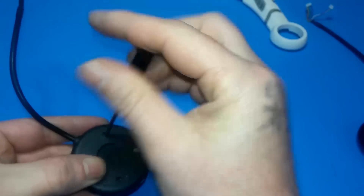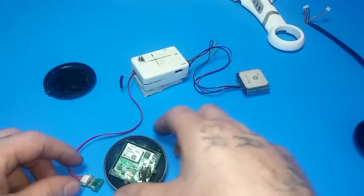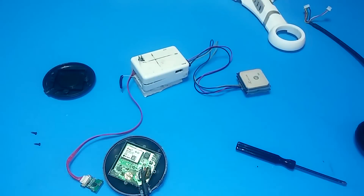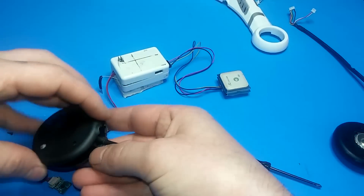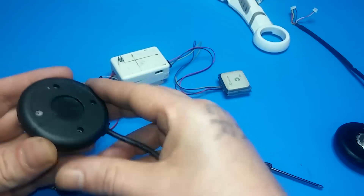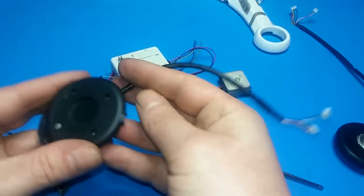Open up this and you can see the compass chip — I'll take a quick picture to zoom in and show you both chips are actually the same. If you're going to mount the NEO GPS inside the CX20, you'll have to take off the back case to mount it on the puck on the back. That'll be up to you how you do it.